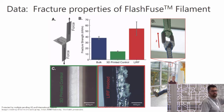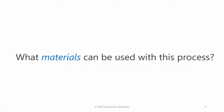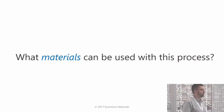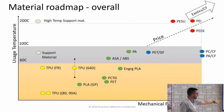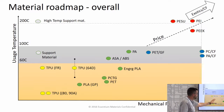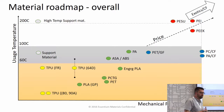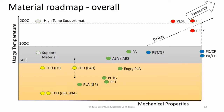You can see results hanging out on a 3D printed chain link where you're stressing all the layers right at those interfaces. What materials can we use with this process? Not one or two, not just six — there are hundreds. We're releasing materials all across the material spectrum: thermoplastic urethane materials with a variety of softnesses, durometers, and flame retardant values; PLAs and other polyester materials; polyamides; PET with glass fiber; polycarbonates and polyamides with carbon fiber; and then the exotics — sulfonated polymers, carbon fiber-filled materials, PEEKs and ULTEMs. High temperature materials, low temperature, and mechanical properties across the spectrum.